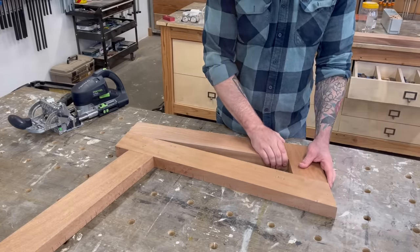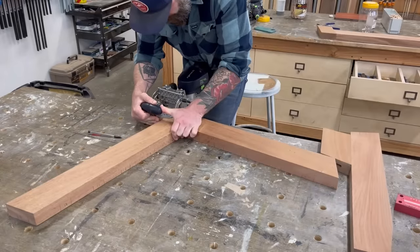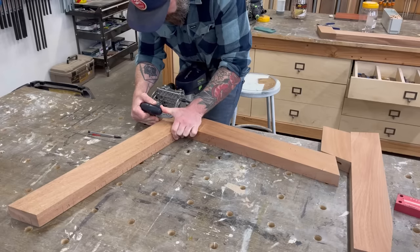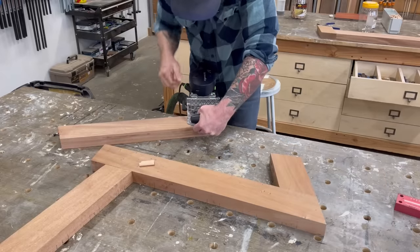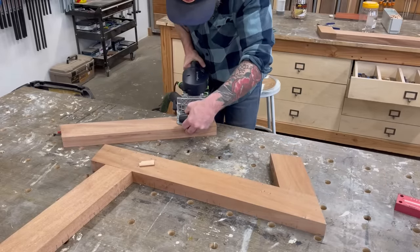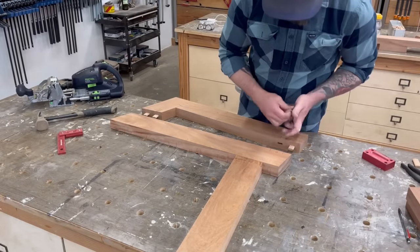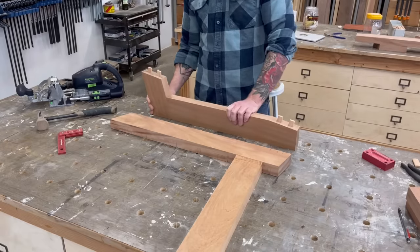I switched to the back slats, getting those all clamped in place. Once everything was clamped in I could start marking out for all of my domino joinery — my plan was to put two dominoes on each side per slat, which should be enough to hold this thing together for the rest of earth's existence. Then I started the long and tedious journey of drilling out all the mortises — about 60 or so dominoes per chair. I dominoed and dominoed some more, and approximately 65 years later I had everything mortised out. I also had to add dominoes for the entire base assembly, so I marked out where all those needed to land and drilled more mortises, making sure to use my patented hip-thrust technique the entire time.